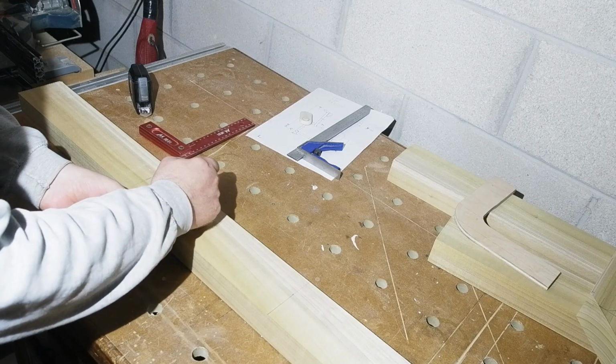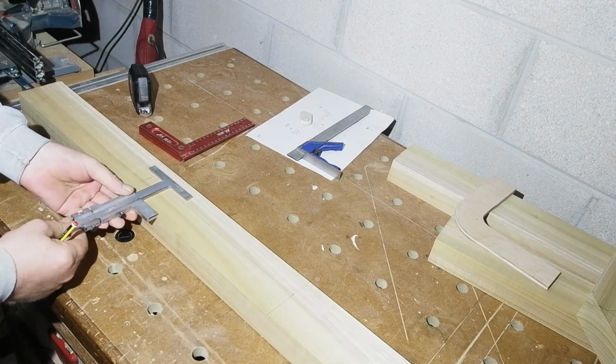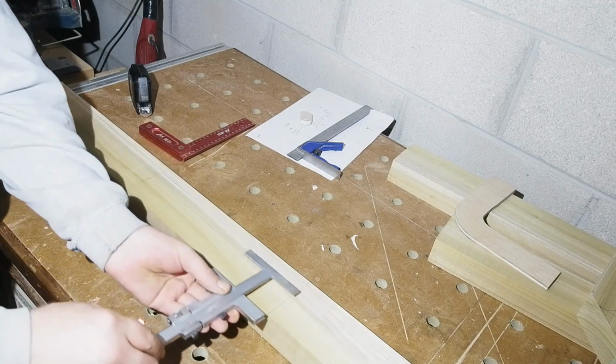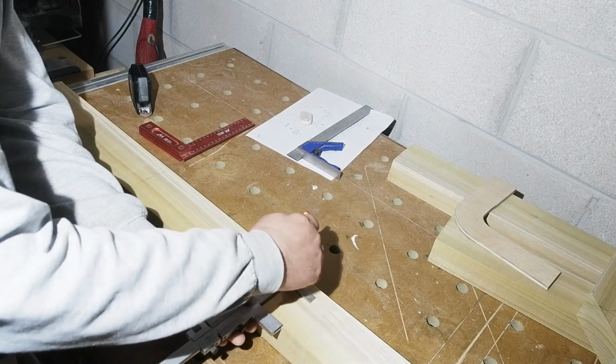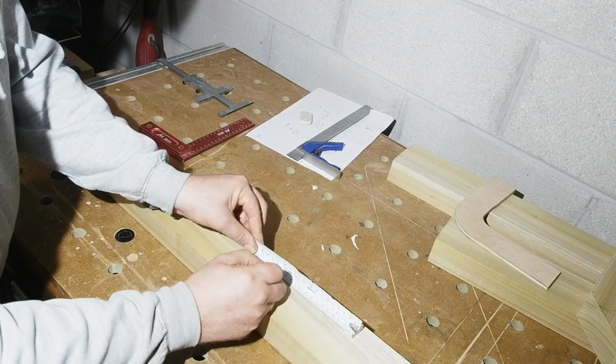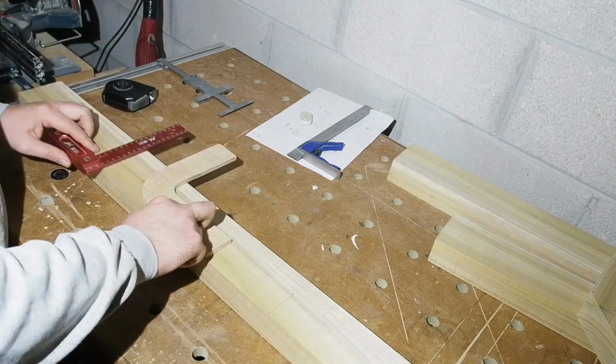Poplar's an underrated wood. If clean lines or straight grain are what you want, it's worth considering. Very easily worked and low cost. Not a great density, so probably not up to fine detail or spindly work, but for my oversized looping frames, not bad at all. Poplar is so often considered the wood you paint, but I'm attempting to enjoy its grain